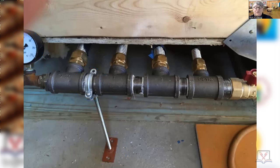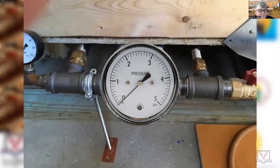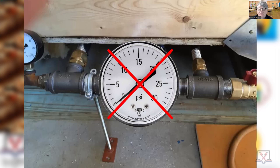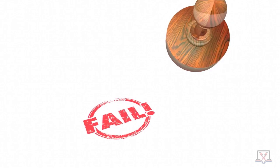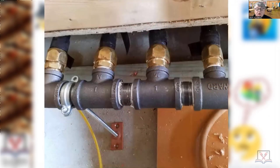This was the initial inspection to get the gas turned on so they could get heat in the house — it was wintertime. The gauge is no good. It should be a five-pound gauge in one-tenth pound increments; this one goes from zero to 30 PSI — not even close to the right gauge. Fail, see you later, re-inspection fee.